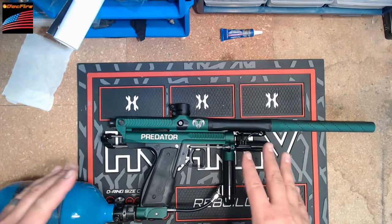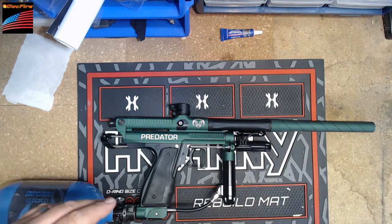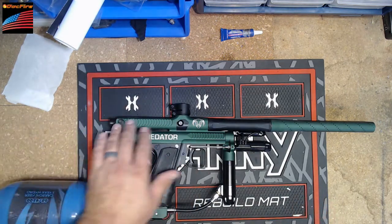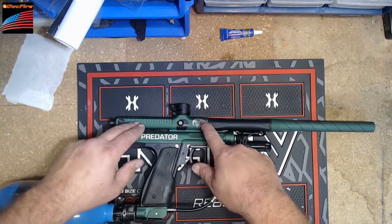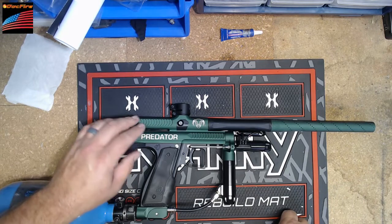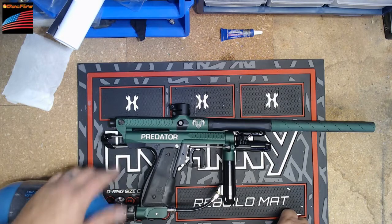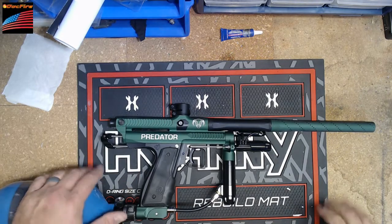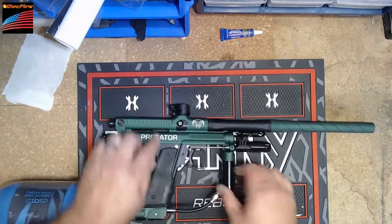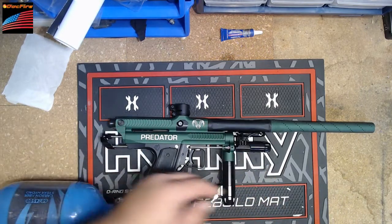The other is, I know Velcro, I can't remember the name of his website, but his tech site, he talks about having a bolt that has O-rings, but just remember these upper tubes are a little larger diameter. Merlin did that back in the day, the AK Merlins. Some of the mil specs they did, the larger tube was a little larger diameter, and they made a specific bolt for it. People didn't realize it for a long time. So you want to make sure that's in there right. It's not too tight, and your O-rings are good.